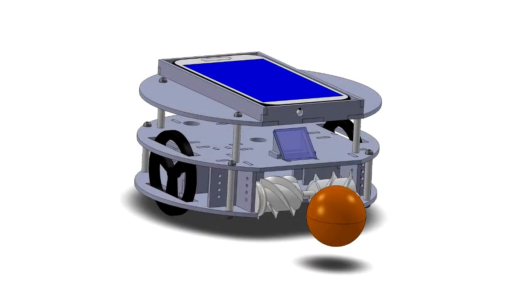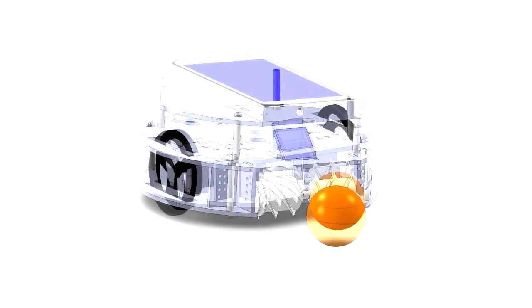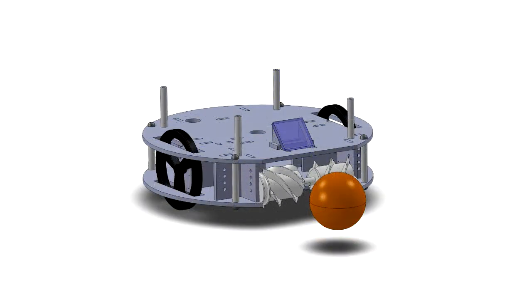I'm Tom, and I'm a member of the electromechanical subsystem working on the chassis design, along with the implementation of the accessory components, such as the dribbling and kicking systems. Utilising the latest 3D modelling software, the mechanical team was able to create a unique 3-layer design incorporating a horizontal foam placement with a down-facing camera slot. Through the use of a custom-cut front-facing mirror, the field of view can be adjusted as required, providing the optimal range of sight configured to suit the designated playing field.